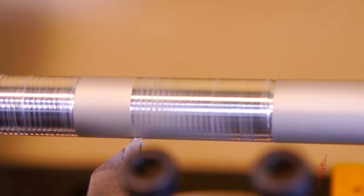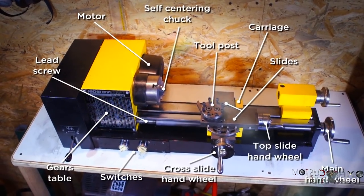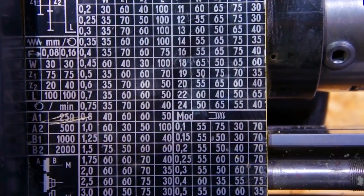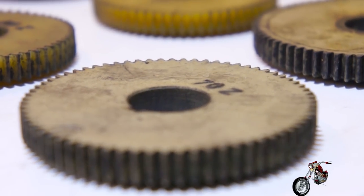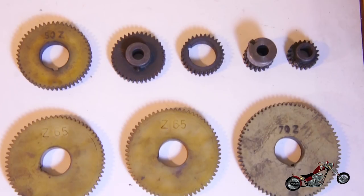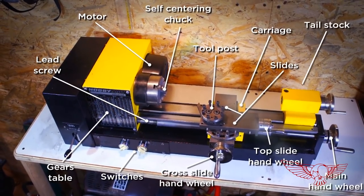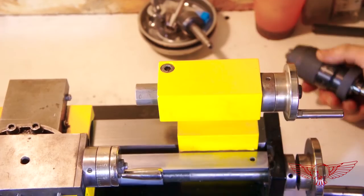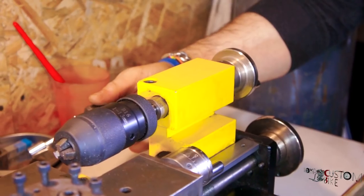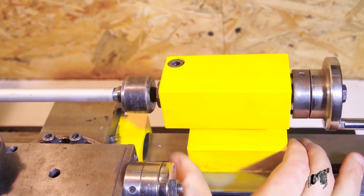The direct relation between the piece rotation and the cutter motion allows us to create accurate threads or more simply to work the piece evenly. To modify the pitch of the thread — between metric and imperial for example — all we need to do is check the gear table posted on the front of our machine. Each pulley has a different number of teeth, and by setting them up as specified on the table you can obtain a predetermined carriage speed to achieve a specific thread pitch. Last but not least we have the tailstock assembly, where we can mount an additional chuck for drilling operations or a dead center, a stabilizing device used to minimize chatter on longer workpieces.